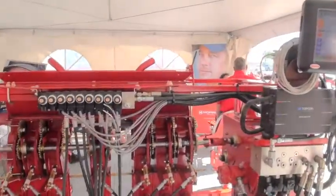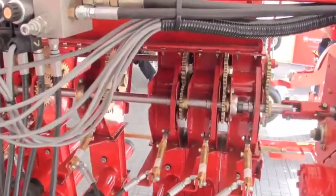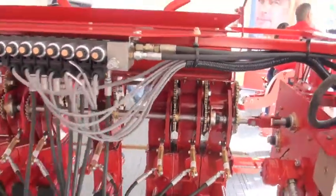Does this kind of system fit into a variable rate seeding situation? Oh, absolutely. Because it is hydraulically driven, the TopCon monitor system is VRT compatible — I've used that myself on our own farm and it works very effectively. This is just another step up from a basic variable rate system. And in terms of simplicity, it's quite simple and very logical. We've all used press drills and hoe drills that use a mechanical gear drive system. This is similar to that, although it has a lot more technology from the monitor system to tell it to engage or disengage.